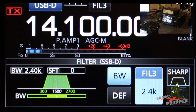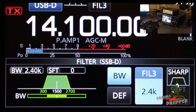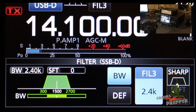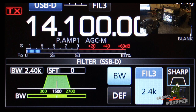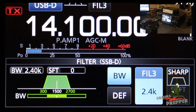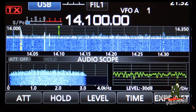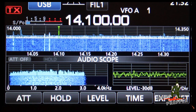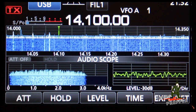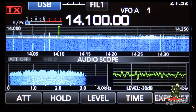To recap: we've reduced our power to 50%, set our bandwidth, and put the radio in USB digital mode. Now I'll roll over to the software and pick a frequency, use the antenna tuner to tune up the radio, and see if we can connect and send and receive some HF radio email. Quick recap: we set our level on the modem, fixed our bandwidth to match the SCS manual's 2.4 kilohertz, and loaded up the software. Now we're going to change the frequency, tune the antenna, and connect to the station.